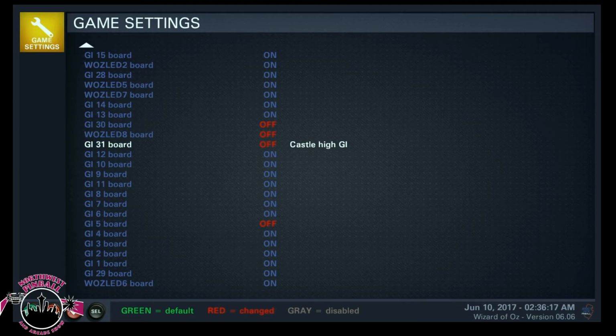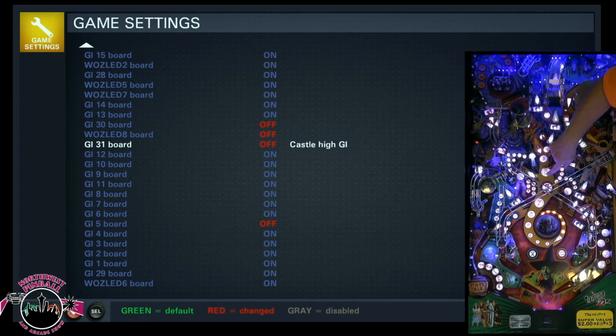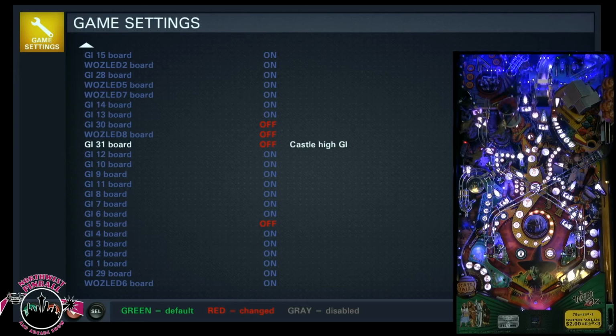Because it is a long daisy chain, it's basically pushing settings for this light through this light through this light through this light. If it doesn't know that this one's missing, when it's done pushing, everything's going to be shifted by a little bit because you've jumpered past one. So being able to configure it and say, nope, this one's not here, it knows not to push data for that light because it's not there, and the stack adapts.